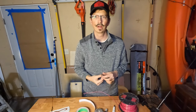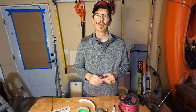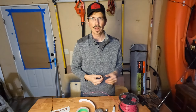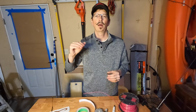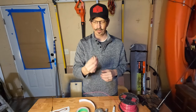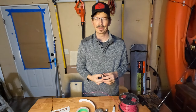With VHF and UHF it's a smaller antenna, so height is might — remember that when putting it up. Get it as high as you can. You don't have to have a lot of height to make it work, depending on where your repeaters are and what the terrain is. I've set them out on the ground with stiff wire — it holds itself upright — and I've gotten into repeaters and talked to people that way. Just try it and see if you can get it to work with what you've got.